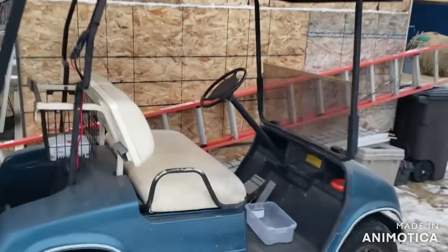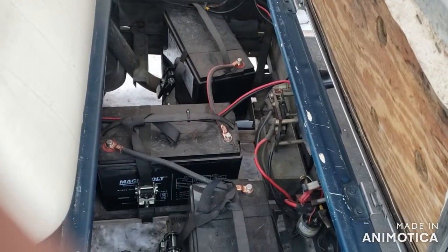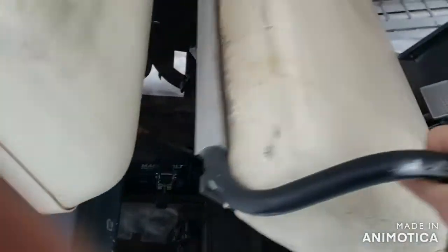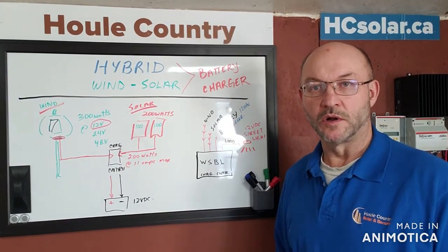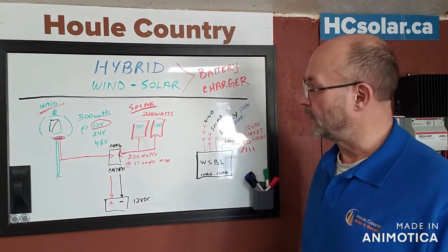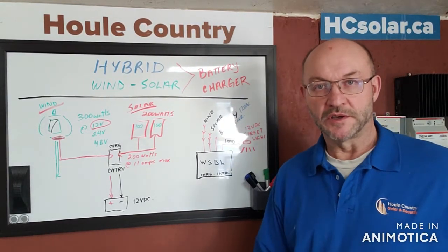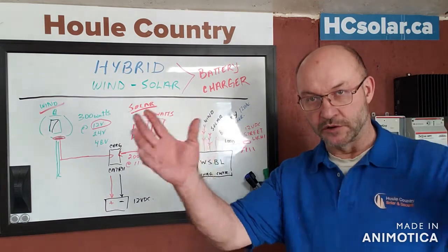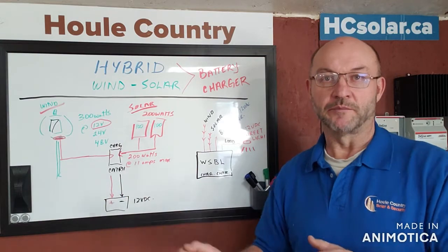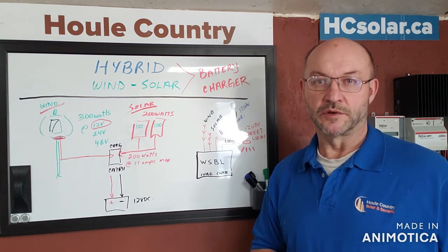The other two panels we're going to take off this golf cart we use in the summer — we'll need the extra power for the winter because we're running that heater. In the golf cart we also have three batteries, 100 amp-hours each at 12 volts. It's a 36-volt golf cart, so we're going to use those batteries. If you're building a hybrid wind-solar system, what you're really building is a battery charger. We want to charge the batteries and use that energy, then invert it to 120 volts.